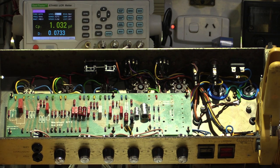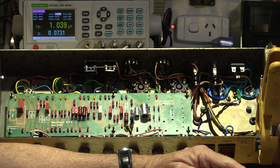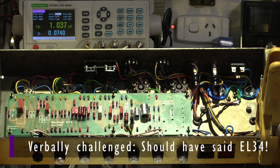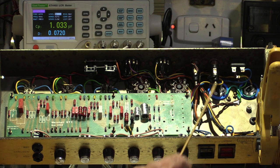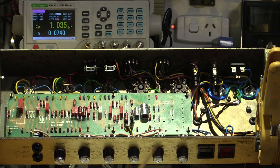Let's have a quick recap. Got the clamp here. The front panel is just sort of pulled away, so I'm just gluing that back in. Okay, so first thing we did is test the EL84s. They were both okay and left in service. Sadly, all three preamp tubes had to go for various reasons: microphonic, this weird ghosting thing, and a crack in V1. Then all these multi-section capacitors, the three of them, two there and one underneath the PCB, had to get replaced. 42 years old, we're just playing Russian roulette to leave them any longer.